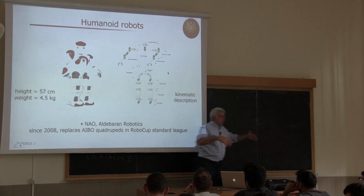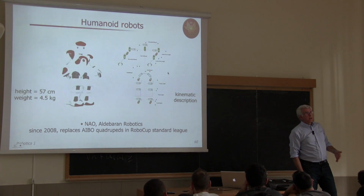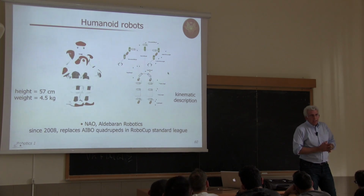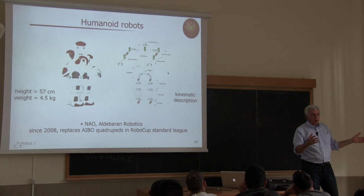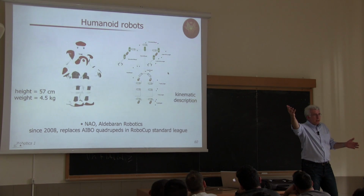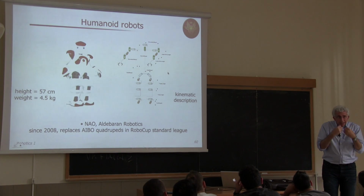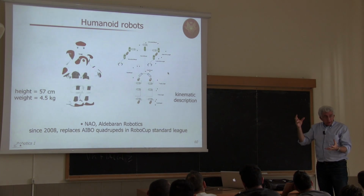And as long as the robot walks and keeps 1 leg in place on the ground, then all the rest has a 3-branched structure of serial parts, from the sustaining leg till the right-hand effector, to the left-hand effector, and to the other foot. Okay? So you can describe exactly in the same way also the kinematics, the configuration of the robot and its mobility.